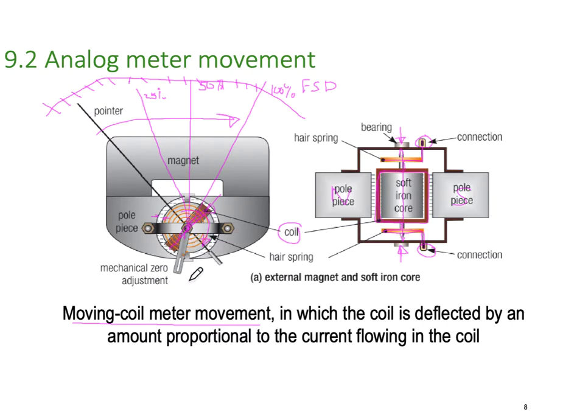Now, a mechanical meter also has a mechanical zero, which is what this little lever arm does here. You can actually get access to it, and you can push it just a couple of degrees. It only moves 5 or 10 degrees either direction. And it just allows you to move that zero point on the meter mechanically a little bit, just so you can calibrate it dead certain across the 0 volts or the 0 ohms on the scale. So that's how you set the zero mechanical adjustment.